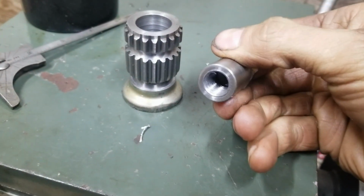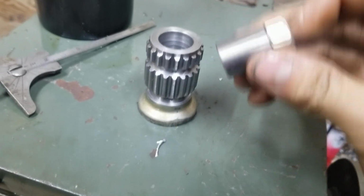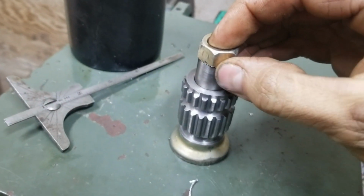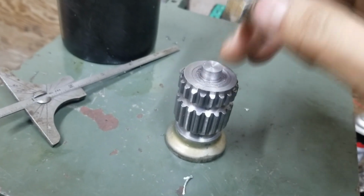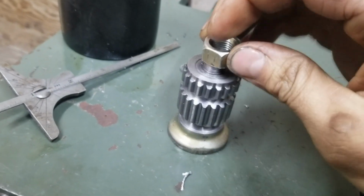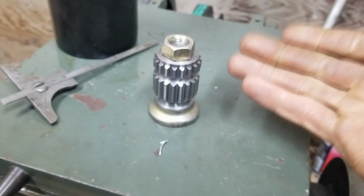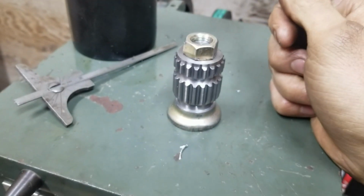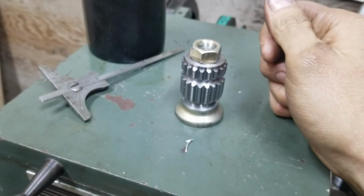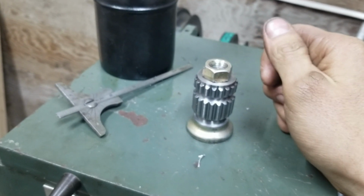And then these are the stock Toyota threads for the steering column. And this extended nut will now go into there. Fits very nice, and it sits flush. Anyways, that'll go down there. He'll be able to tighten it down, and he'll have a steering wheel that's quick disconnect. So that's sweet. As far as I know, I think I got everything that he wanted done.